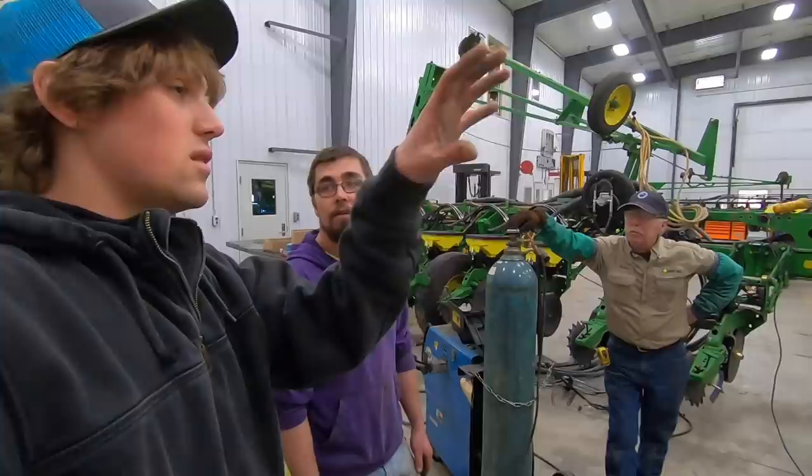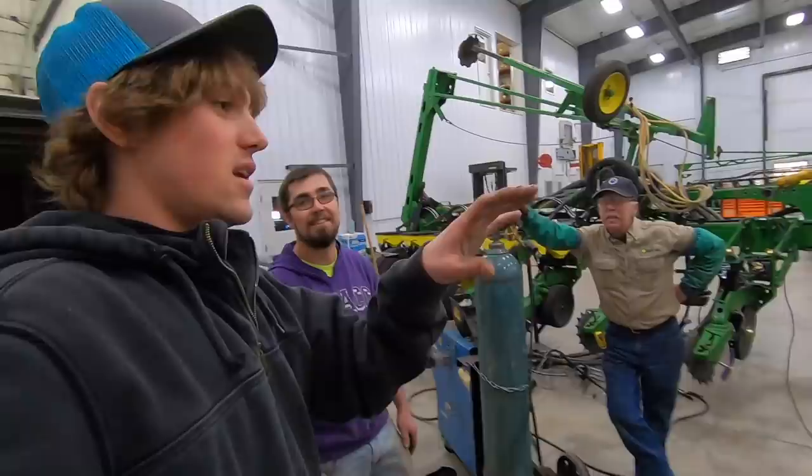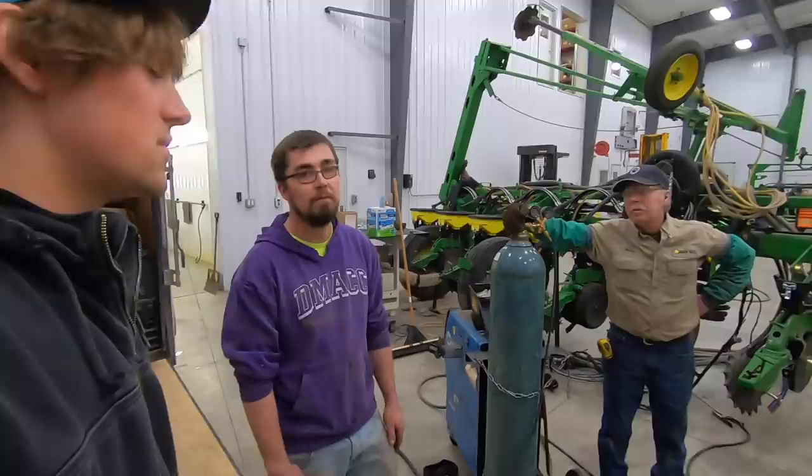We are working for LDM AG and we'll be installing a weight distribution kit for the 1770 here. What it'll do is — because the mainframe of the planter is so heavy — it'll actually push down on the wings and take some of the weight off the mainframe, making all the row units play evenly. You get less weight to the center, which would definitely help in muddy field situations, lessening the weight behind the tractor and putting more weight towards the outside so you may not get stuck as easily. It also helps with compaction on headlands.